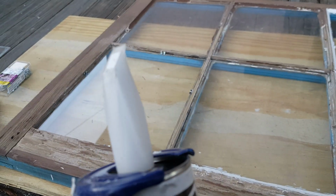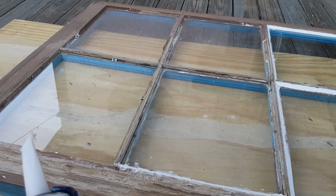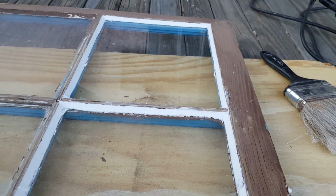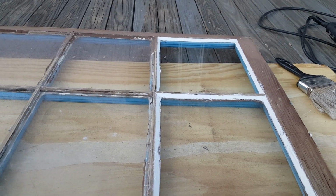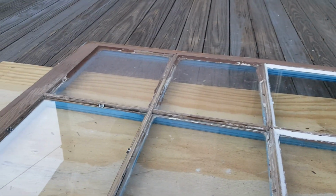In this case, I'm going to use it sideways, since sometimes the thicker part of it will be too much. So I'm going to use it sideways, just like I did there, and I'm going to make some corrections with the 1-inch spatula that I have. If you notice, sometimes you have a little excess around, and the idea is that once you finish painting it, you can correct it with a small razor, like a razor blade, or a utility blade, and that will help you out. Also notice that I'm placing it in the other ones after I remove all the old glazing.